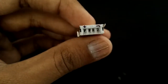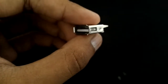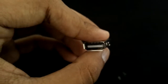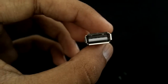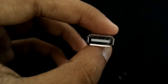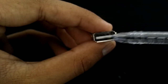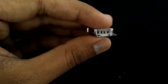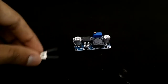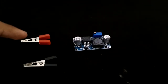The female USB port you can get from any electronics shop near your home for about five rupees. The most important thing about this USB port is that you have to connect the positive and negative correctly, or there is a high chance you'll damage your gadgets permanently. You can remember it like a graph — the plastic bar is the X-Y axis, the right side is positive and the left side is negative.